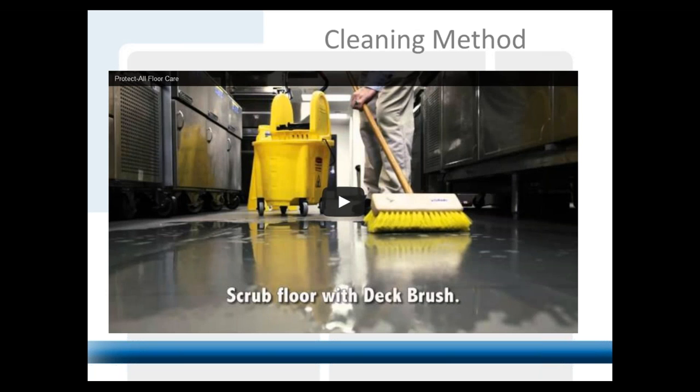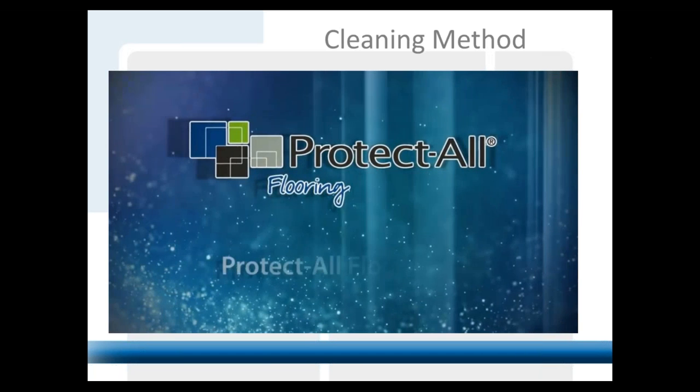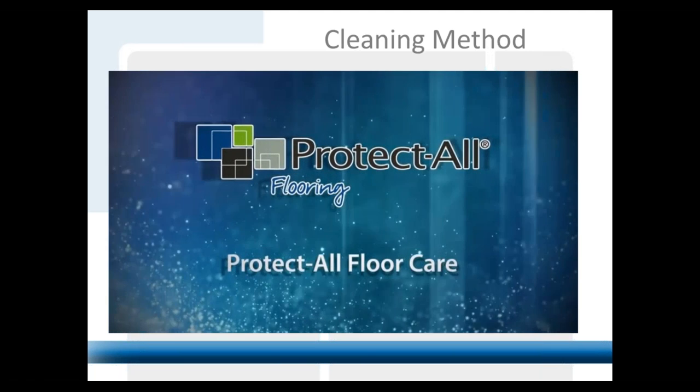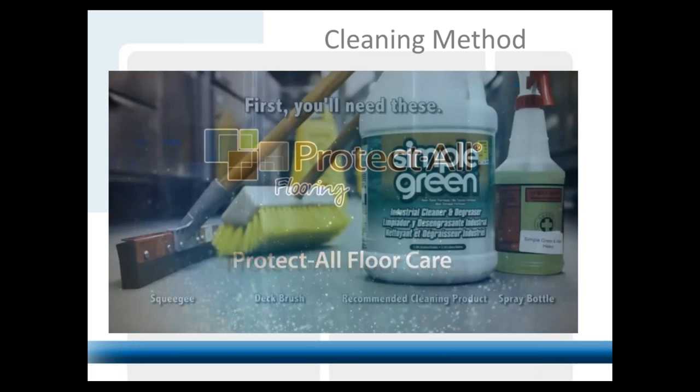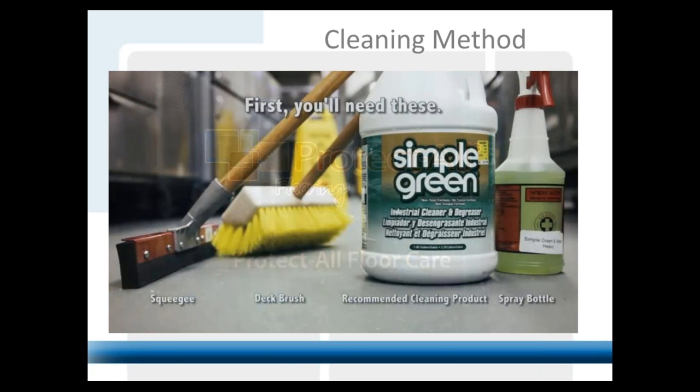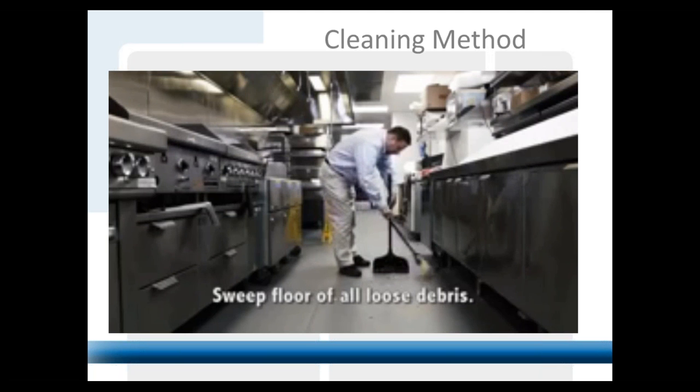As for cleaning — a deck brush and some Simple Green. This is a nice video to show how easy it is compared to quarry tile or a granulated epoxy floor in a commercial kitchen. With grout lines, when you mop over fat and grease, you're smearing it into the grout and eventually tearing it down — and it's never actually getting clean. It's just bacteria and growth accumulating in the kitchen. When you walk into a kitchen that smells, that's the bacteria in the grout. I personally won't eat at a restaurant if it smells back there — that's their level of cleanliness.